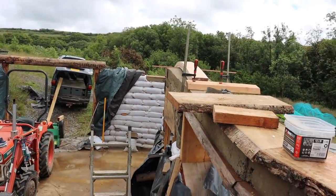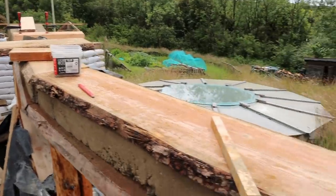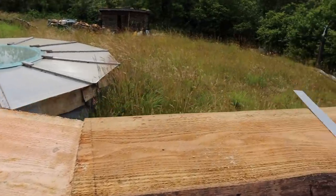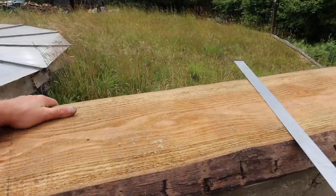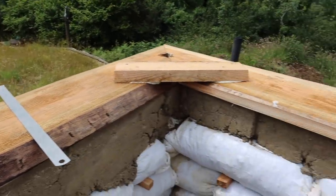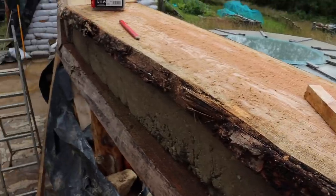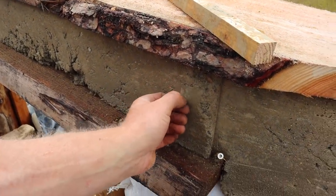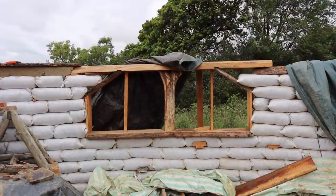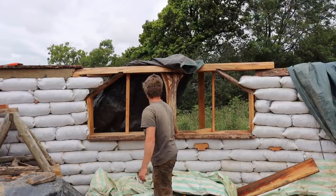The glue lam piece is going to add a lot of strength, so yeah, pleased with that. And then we're going round with the wall plate, plating everything. It's all going to get plastered in, it's just going to add a lot of tensile strength to all this. And I say this is getting a lot harder than it was. I could pick it off with my nail before. Right, this is a bit of an exciting milestone. I can knock these supports out now.